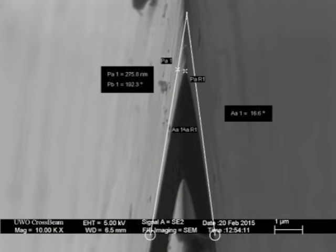Now, what I want to show you here is what they did on this particular picture. I realize that the resolution here is not as good on this particular picture. I couldn't get it. But you can see the white line is the bevel itself. That's the inherent bevel. Let's say that's, what, 16 and a half degrees? So the micro-convexity is the darker part on the inside. Okay, so that's what happens when you strop. That's the micro-convexity. Now, there's a scale marker here. This is 1 micron. You can see the amount of metal that's actually missing is fractions of a micron, okay? But it's still there.